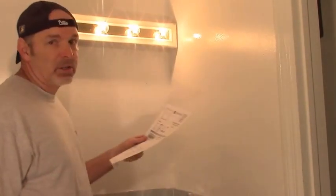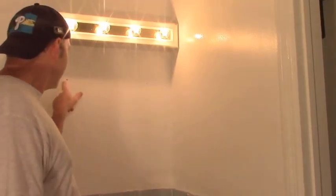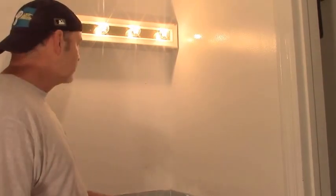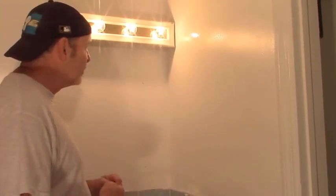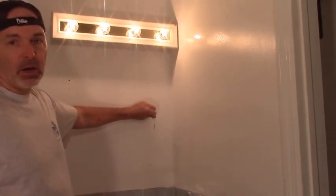I know there's studs in this wall. I've already seen where they are, so I'm just going to find them real quick. You can do the old knock test and listen for solid as opposed to hollow in the wall. That's real hollow right here. That's solid. There was a cabinet here already and there's holes in the wall, so I know that's where they drilled into the stud. But if they weren't there — I have a hollow spot right there — so I'm just going to take this wall hook that you can use to hang pictures and stuff, and stab it through where I think there's a stud. Yeah, it's right there, because I went through and I couldn't go any further.